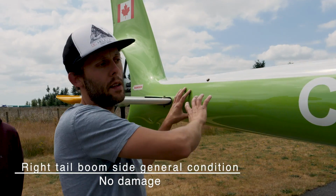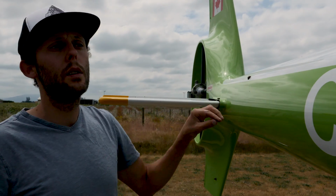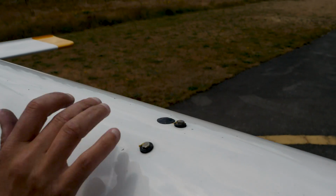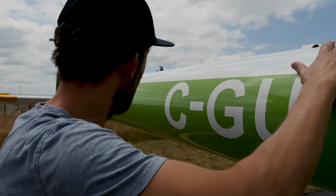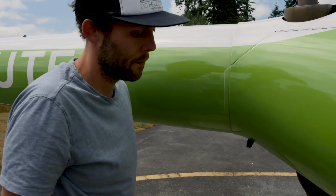Same thing here, we're going to look down the tail boom. Also going to have a look, make sure these bolts that hold the hangers for the bearings are not coming loose. And also that the rubber that is around them is not getting really cracked. They start to crack pretty quickly, small amounts, but they shouldn't be separating and cracking. So we're checking that as we check the tail boom. That was the last thing in that section, the bearings, bolts and plugs. On section 5, the muffler exhaust, check and check.